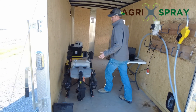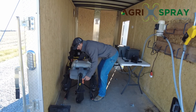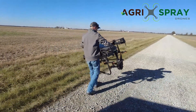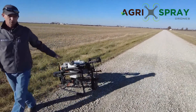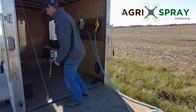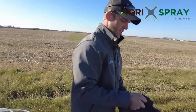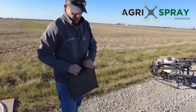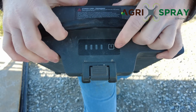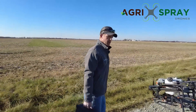Here's the T30 — one person can carry it, especially with the battery out and an empty tank. It weighs about 62 pounds as it sits right now. Before I unfold it, I like to go ahead and put a battery in so it boots up while I'm unfolding it. The T30 batteries are a modular wireless design — essentially like a drill battery, they just plug right in. Click on the power icon to see the charge level; this one's fully charged. Then you can turn that battery on.